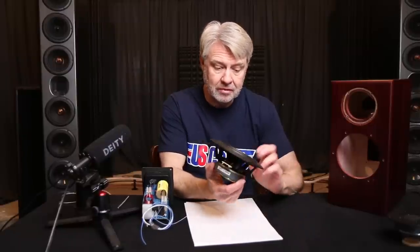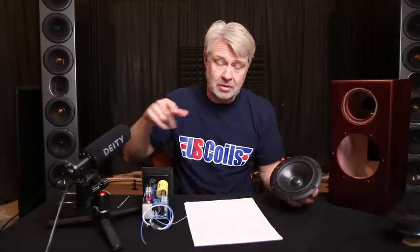The little woofer is made by a company we've been doing business with since about 1996, called Peerless of India. They make a nice woofer — they make quite a few of our woofers. Our M130 is the same frame as this woofer; the dust cap's different, the profile of the cone is a little different, and the voice coil winding is very different, but overall it has a lot of similarities. One of the good things about this driver — a lot of it has to do with the cone material — is that it dissipates stored energy very well. It's very well damped. At the very top of its range there's a little more breakup in this one than what we see in ours, a little peak up there, but it's pretty high up in frequency so it's no problem.